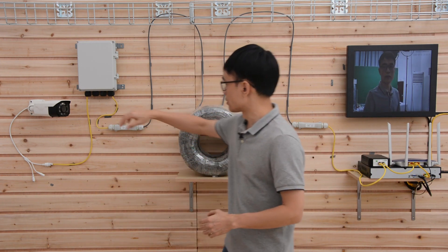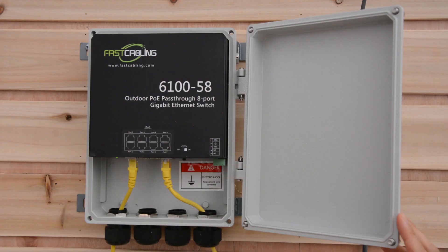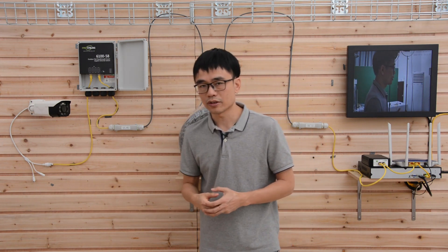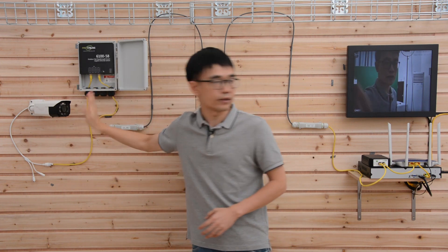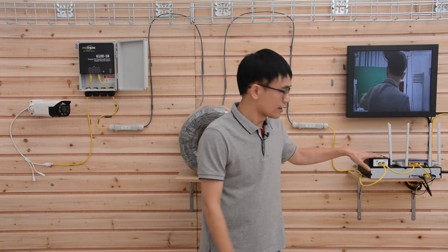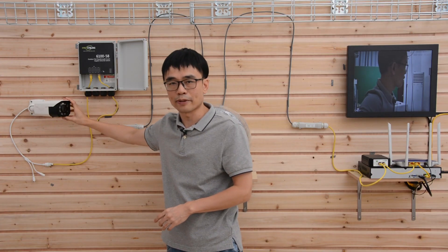Now let's move to the edge — the new location. This is the outdoor PoE switch, which has a total of eight ports. This outdoor PoE switch has one critical feature: it can be powered by another PoE injector or PoE switch. There is no separate power source connected to this switch, and the camera connecting to this switch is live. This means the PoE injector is supplying power for the two PoE extenders, the PoE switch, and also the PoE IP camera. The system is working.